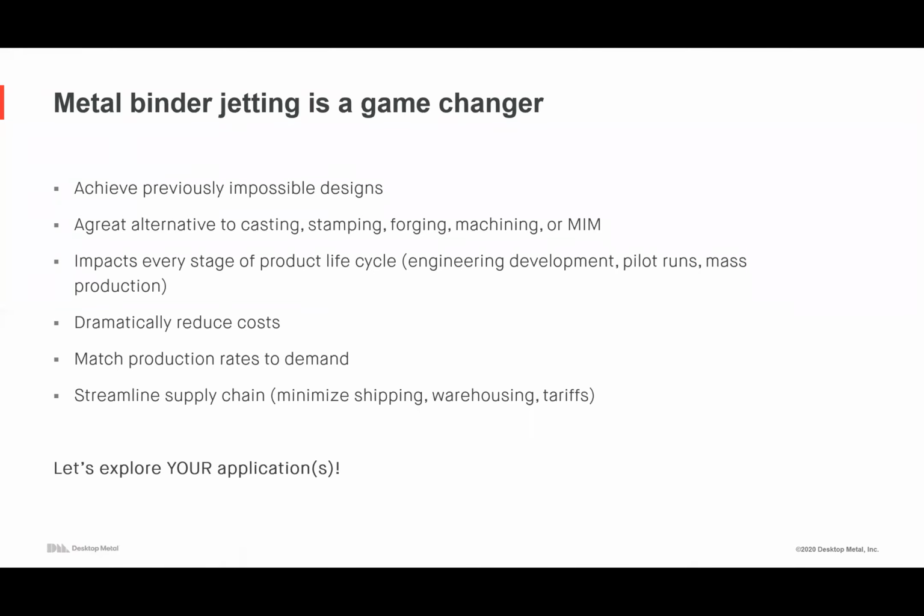Another question on part size. Obviously these are smaller examples, so what's the optimal part size, how big, how small? What I don't recommend is what my colleague Jonah, who's leading the project, has done, which is print a giant manifold bigger than my head. Yes, it's a nice existence proof, but that's not the kind of part you should be printing. I would say small. Everything that's MIMmed, small might be a golf ball size part. You can do much smaller. People have printed tiny hinges, little clips, custom clips for smartphones, where you can make literally thousands, or even tens of thousands, in one build.